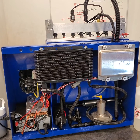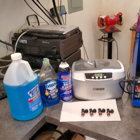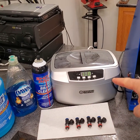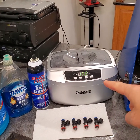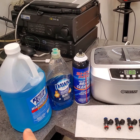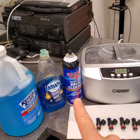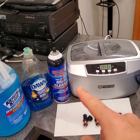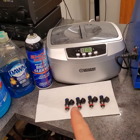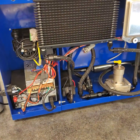This is not your garden variety clean and flow bench. If we want to clean injectors, that's what this stuff over here is for. An ultrasonic bath that we can get pretty cheap at Harbor Freight or Amazon does most of the work. All you need is a solvent — which is what methanol is in the windshield washer fluid — a surfactant, which is what soap is, and something that can clean it off when you're done. You need to displace all that water and get it nice and clean. That's what brake cleaner does. If that doesn't clean your injectors, we are probably not ready to use them for a high-performance application.